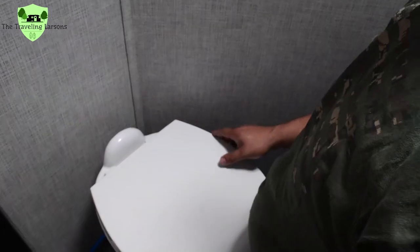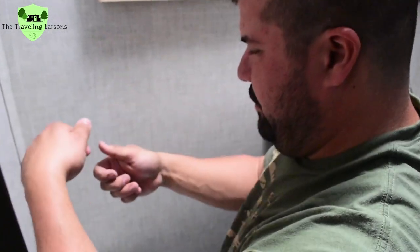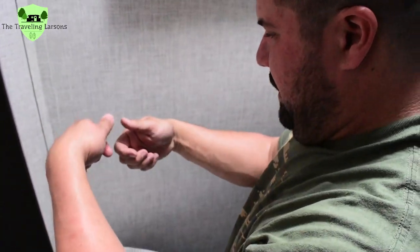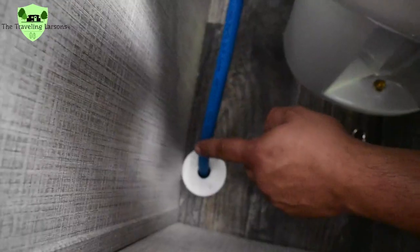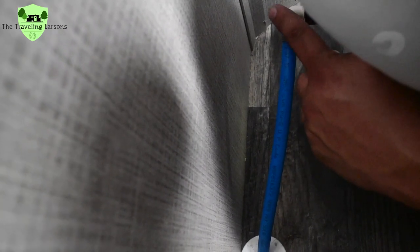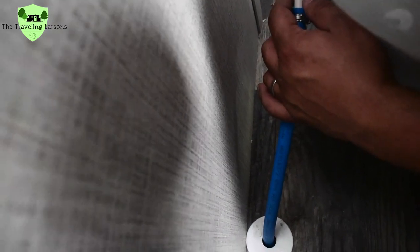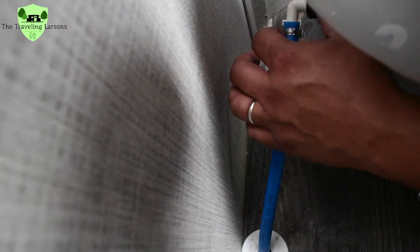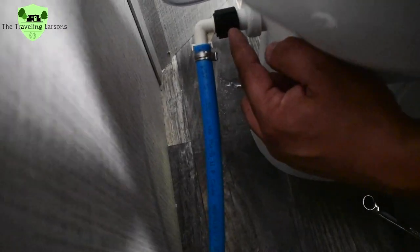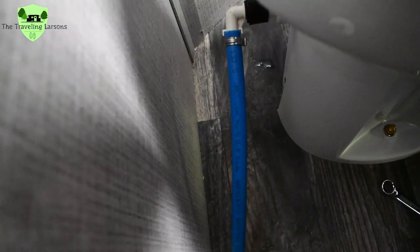Tighten that supply line one more time. A lot of times on those supply lines, if you put two fingers on one side and two fingers on the other side, it'll almost act as a wrench instead of just using two fingers to turn it. This blue pipe here is the actual supply line. If you follow it, this is a fitting that holds this 90-degree elbow into the blue supply line — that fitting just crimps around that pipe to hold the 90. This black nut secures to a threaded connection on the back of the toilet. You just want to get that finger tight.